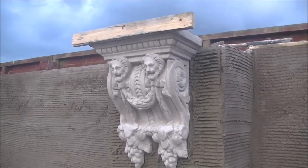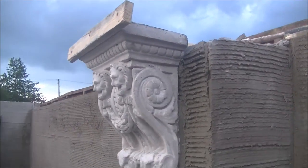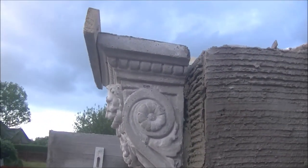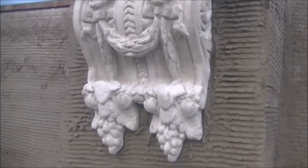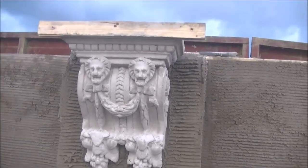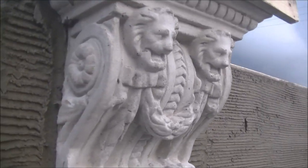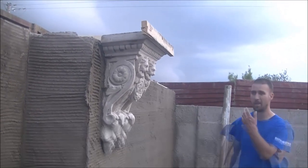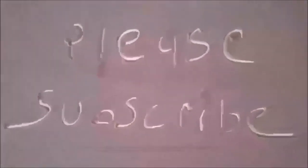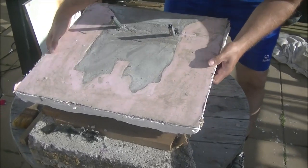So it's just a matter of getting it as level as possible. Quite awkward things to fit — this has a bit of weight to it, not overly heavy but heavier than if it were fibre plaster. That's it completed. I think it's looking pretty smart there. Put a little batten on the top just to hold it in tight as well. I'm going to stand here for a few minutes and let it set its way through, so just leaving that batten on hugging it to the wall and holding its shape.